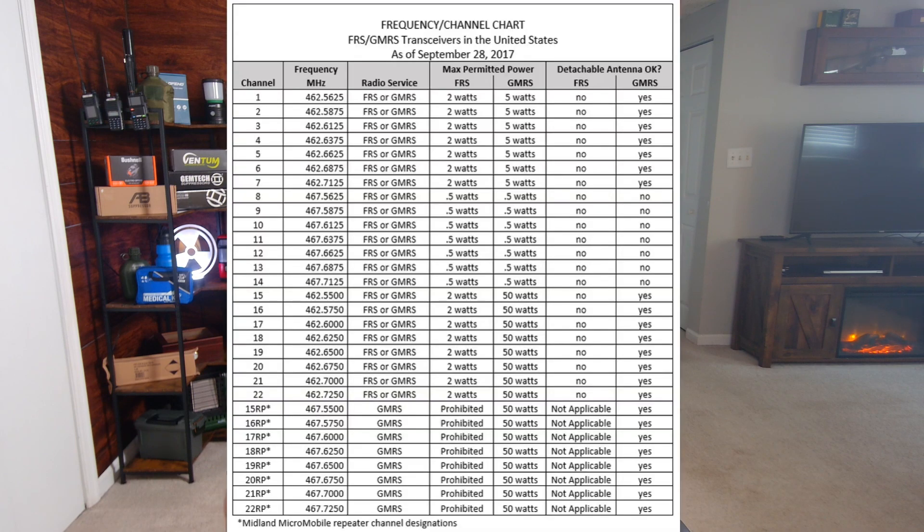Let's start with GMRS really quick. GMRS has limited repeater channels — there are eight repeater channels and they share frequencies with the eight simplex channels. If you have two GMRS repeaters in one town or area that you can receive both at once, and they're both on, let's say, channel 21 — GMRS repeater channel 21 — and there are two different tones: one has a tone of 141.1 and the other has 207.1 or whatever they are.